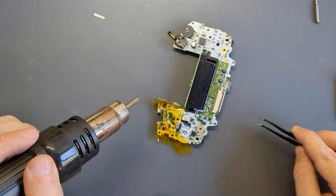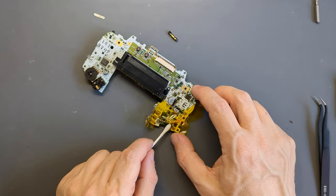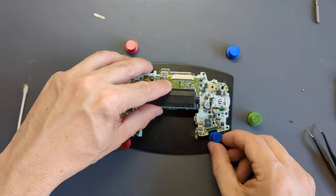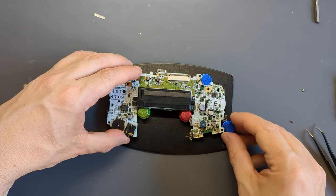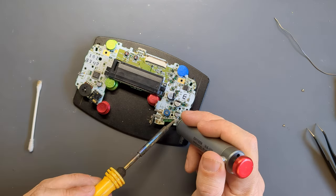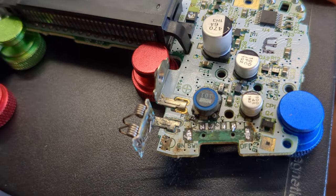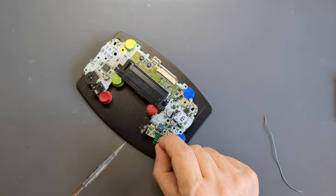Afterwards, I used the tweezers to reheat the solder and lift out any broken remnants of that ground shield. The overall area was quite dirty, so I cleaned it up with isopropyl alcohol and a cotton bud. I wasn't going to be using a heat gun beyond this point, so I carefully removed the tape and set up the motherboard on a magnetic PCB clamp I got from eBay that's quite handy for holding these little motherboards from handheld consoles in place. I used my soldering iron and solder sucker to lift off any remaining blobs of old solder, added some new solder to refresh the pads, and since the pads looked a little worn I added a good layer of liquid flux all over the surface and on the back of the new switch before putting it in place for soldering.